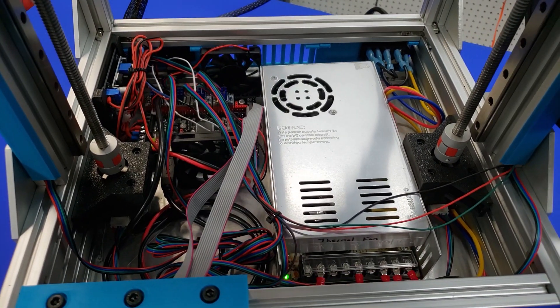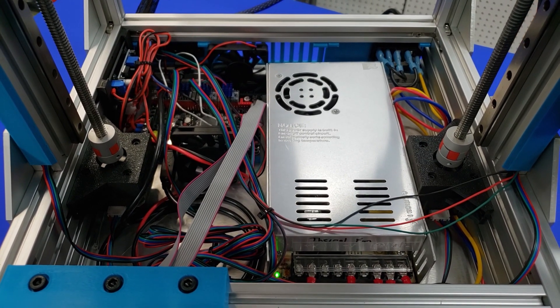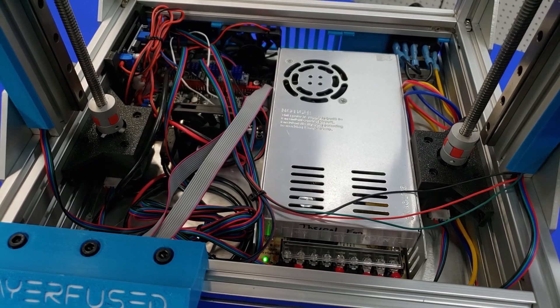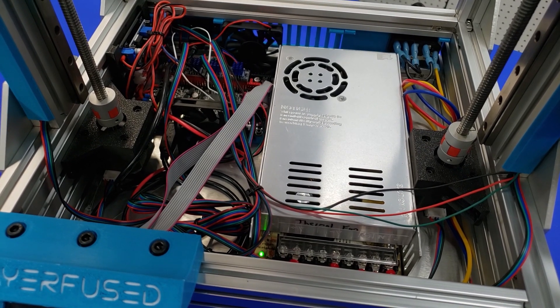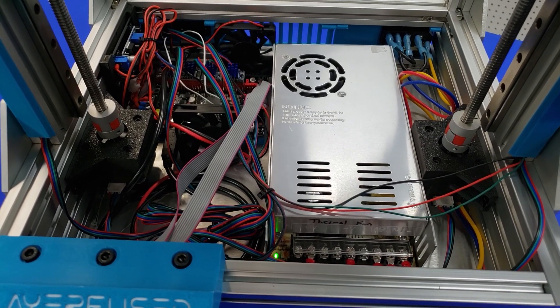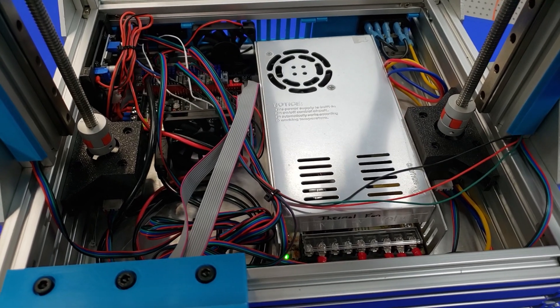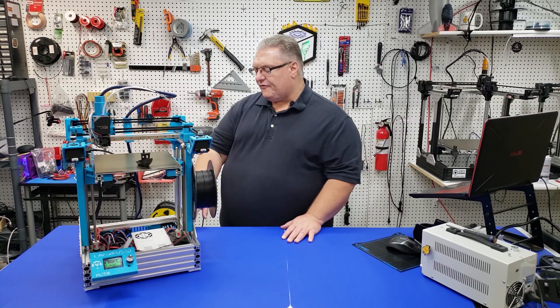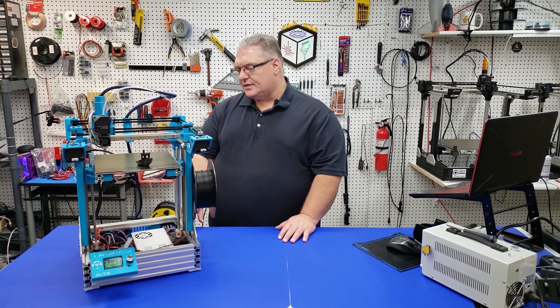I did add additional cooling fans in here. Once the cover goes on, there are actually two 60-millimeter muffin fans in here, and those muffin fans are blowing the air out of the case. On the front here, we'll have some air entryway in the cover that will basically cause that air to flow and suck out from the front to the back.